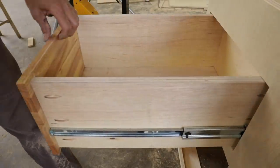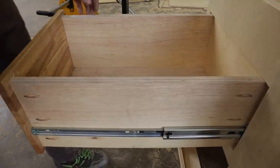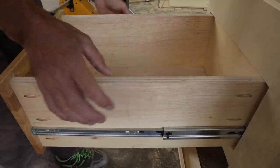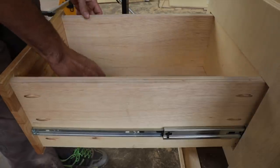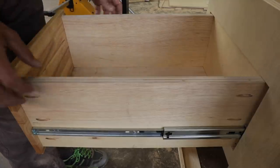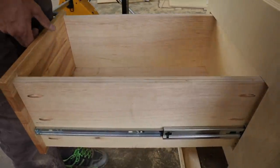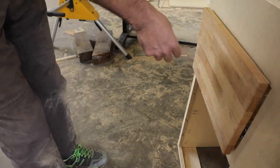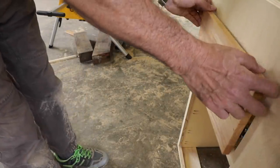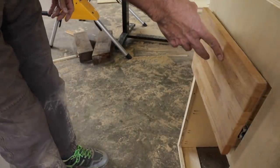Here's a little different angle. I used three-quarter inch plywood — it's probably a little bit heavy, but I did it for the convenience of using my pocket screws. I put a quarter-inch bottom in it, rabbited in. Really heavy ball-bearing slides that do the soft close so it won't rattle out on us. You can put a lot of stuff in that little drawer.